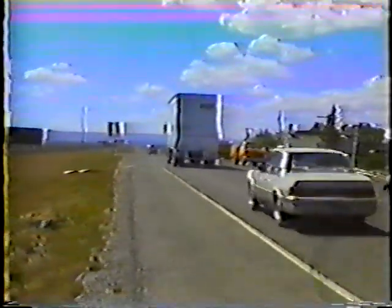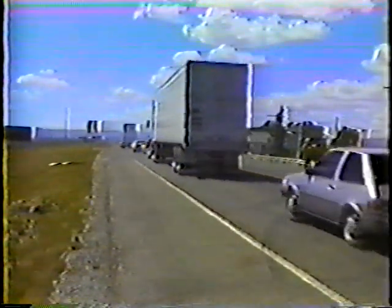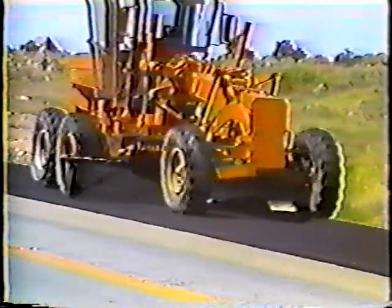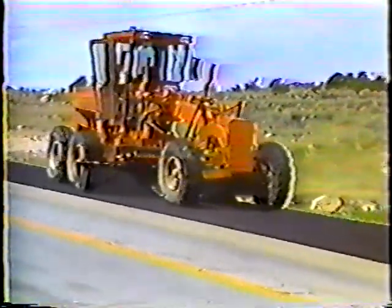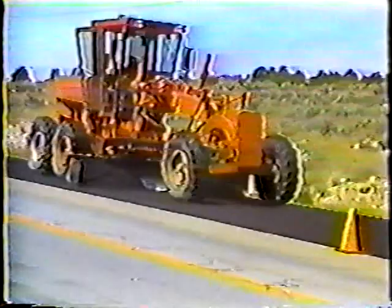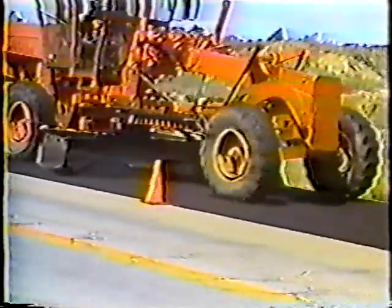That's just a quick look at the overall procedure — now let's go back and look at each step in detail, beginning with preparations. The surface has to be both smooth and level before seal coating begins, and any repairs should be done well in advance. Doing repairs early allows time for them to cure. Waiting a few weeks after pothole patching gives the patch a chance to be completely cured. If we didn't wait, the liquid asphalt from the patch would most likely bleed through the new seal coat.